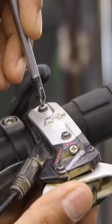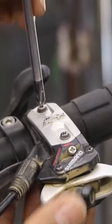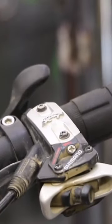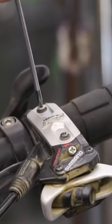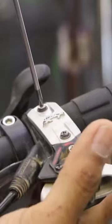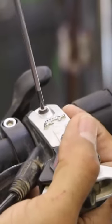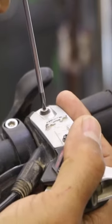Because you don't want to strip these and get them stuck in there. Usually once I get in there — I think this is a number two Phillips, but this might be a little bit big — I'm going to drop down to the smaller one. You can get a feel right away whether it's a good fit or not. Now I want to apply good pressure going down, very firmly. That's going to give a good bite and limit the chance of stripping, especially if they're stuck.